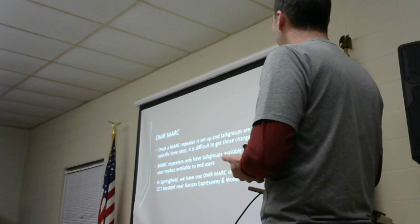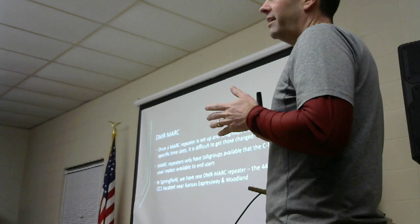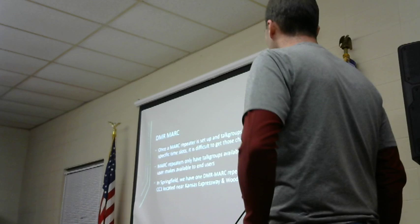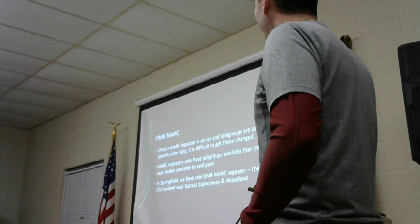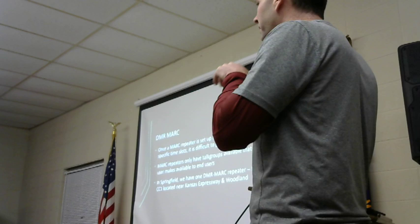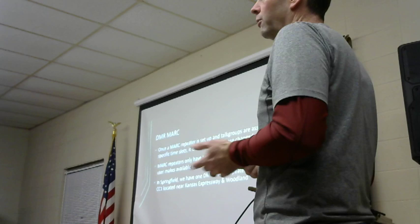These are some of the disadvantages of it. When the repeater is set up, the repeater sets the time slots. They tell you what's available, and you can't change it as an end user. And it's 442-375, I got that wrong. All the programming takes place with the C-Bridge. On the MARC network, the repeater owner tells their server, I want these talk groups available on my repeater, and that's how it works. So if you try to key up on a talk group that's not available on a MARC repeater, it's not going to work.